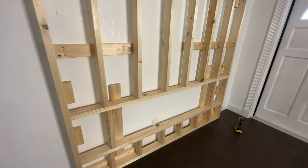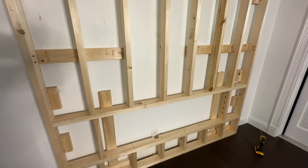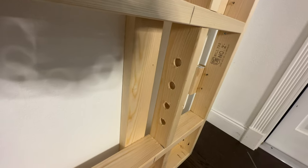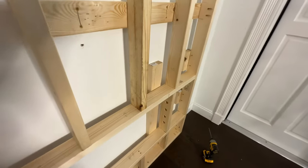As you can see in the video, I'm using the laser a lot — that's not necessary, it's just something I have that makes the job a little easier. I also drilled some holes in the side 2x4. There are a lot of warnings about making sure the fireplace can vent properly, so those holes are there just to add a little extra ventilation.